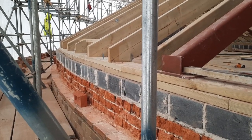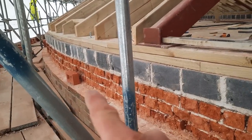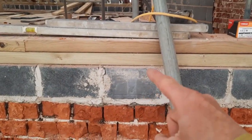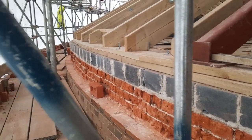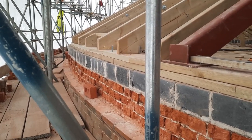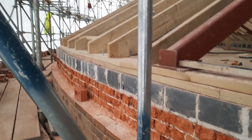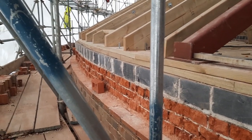I'm going to raise up an extra three, maybe four courses along here. The problem we have is this brickwork along here does vary a lot. We saw that where we had to cut these 140 blocks to get them in, and they were tight on that bit. Then as they go around we found we had like a 30mm bed. So the first thing is to recheck the level of the brickwork in relation to the wall plate, because the wall plate has gone on level — that was all lasered in with the blockwork.